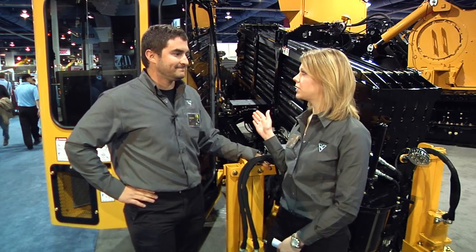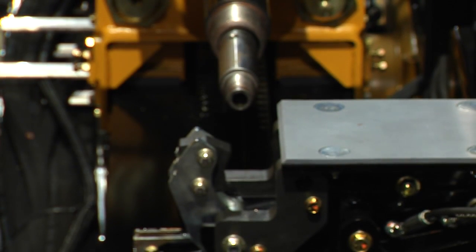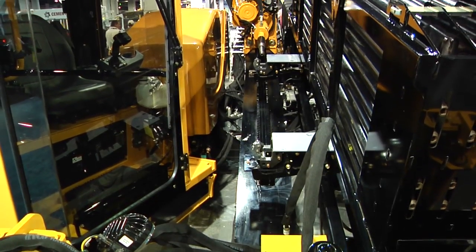And what makes this drill stand out above the rest in our industry? This drill stands out because of the ability to get fluid down the drill stem. So if you look at our drill stem, the inner rod is hollow and so the drill fluid flows not only in the inner rod but around the inner rod, so we can get more fluid down the hole.